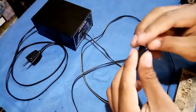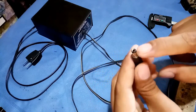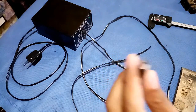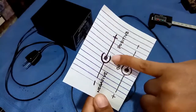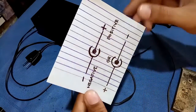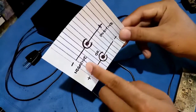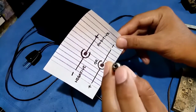There are many various types, but here I'm using this for my Audio Technica portable speakers. The center I will make positive and the outside is negative. There are two types of polarity — it has markings like this: positive here, and this one here is negative. In reverse, the outside is positive and the inside is negative.